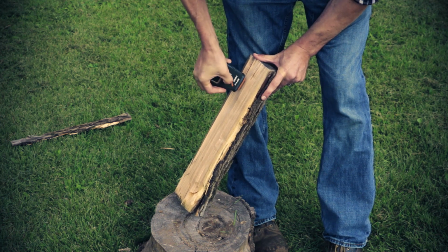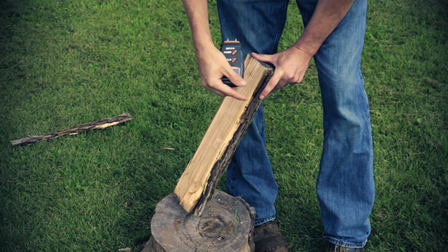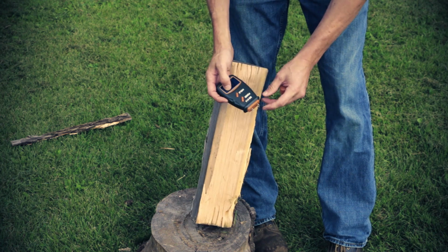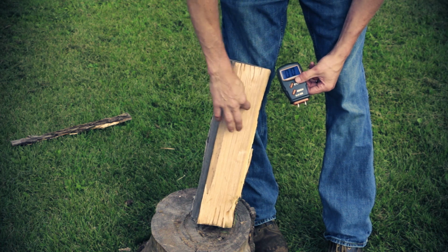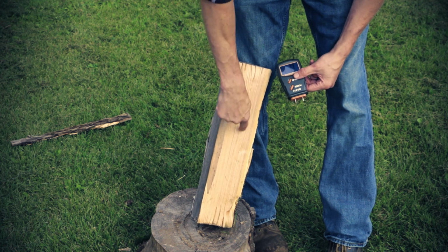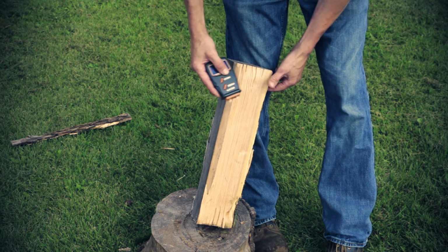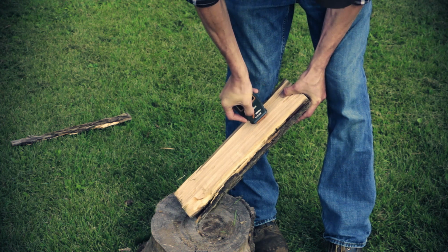I've read stuff talking about, oh, you should do it across the grain because then you get a more even reading. However, the way these meters actually work, there's basically a resistance between the prongs, and there is more of a resistance going across than with. Supposedly what I've read is there's a 2% difference between them. So I run it with, and then I take my reading.